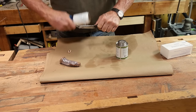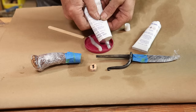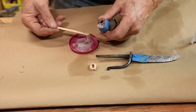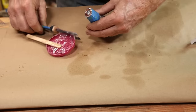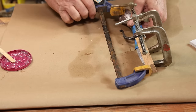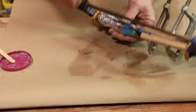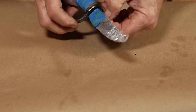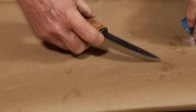I'm putting some plastic wrap on the blade and the antler so I don't smear glue all over that accidentally. Then mixing up some epoxy — I prefer a slow setting epoxy so I have plenty of working time and don't have to worry about it setting up before I'm through putting the whole thing together. This is hard to clamp up, so I put some sticks on either side of the blade just to give me a clamping surface and then use a bar clamp to clamp end to end. This does a really good job and I don't think I need any kind of pins or other fasteners on this knife. Modern epoxies do a remarkably good job and they also keep moisture out so you don't have to worry about moisture and corrosion happening up inside the handle.